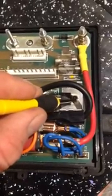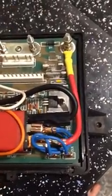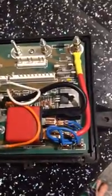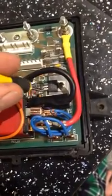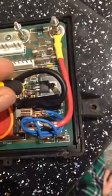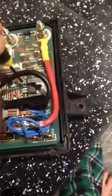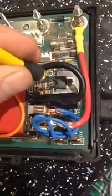This is a new one here — as you can see I've bolted it on rather than riveted, which is standard. When you plug this in to a C5 or a test loom, negative in the middle, you should have 12 volts this side and 5.6 volts that side. If that's not working it could be this IC. You can also follow the circuit board from underneath to see where this goes — it does go around to R1. R1 is really common; the IC is not as common. Diodes are also common — there are two diodes, one there and another one just down there — but when those go they're usually obviously fried.